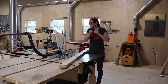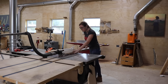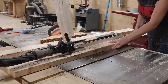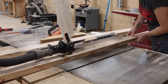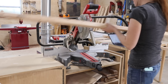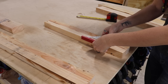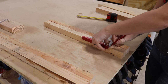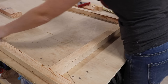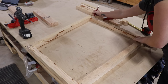This will be an insulated dog house, so instead of going with my first instinct which was a plywood body, I went with more of a framing design made from 2x4s ripped in half. I first sent the 2x4s through my table saw to take off the rounded edges on both sides, then readjusted the fence and cut them directly in half. After getting them cut to width I cut everything to length at the miter saw. I started by constructing what will be the two sides, coming up a few inches in a few places to give the house some small feet to get up off the ground — mine will be under a covered porch and should stay dry, but just in case.